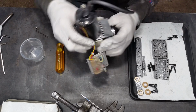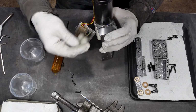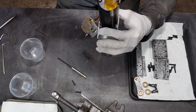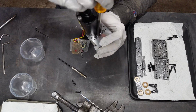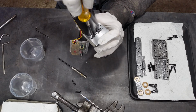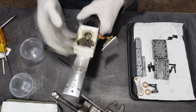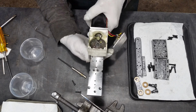Backtracking a little bit, we're getting the motor here attached to the chassis via those 4-32s that go into the end of the bearing block. I spent a great deal of time making sure this connection was square and gets those gears together properly. I really would have liked some registration or a set of locator pins to do it, but honestly I've had it apart 3 or 4 times and it seems to go back together every time with a pretty good mesh. Okay, let's just make sure we got a mesh there. That's looking pretty good.